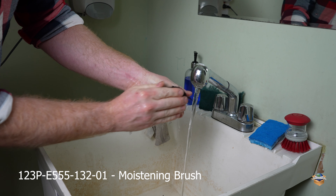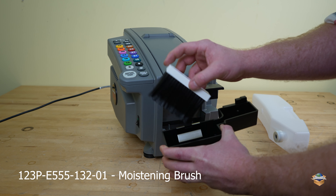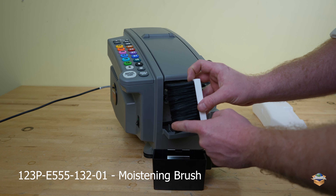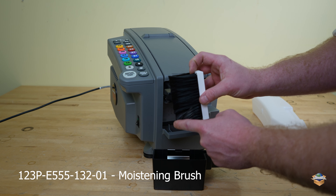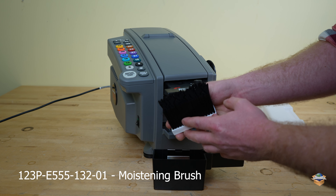When you wash them, you'll kind of see the white of that soap come out. If your brushes don't look this clean, I suggest taking your moistening brushes, setting them upside down in your tank with some fresh water, and letting them soak overnight or for at least an hour. That way when you pull the brushes out, the tips have had a chance to moisten and the glues will break off more easily, and the brushes will clean up a lot better.